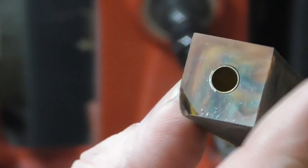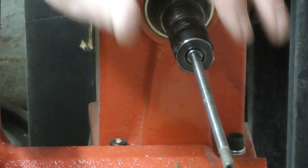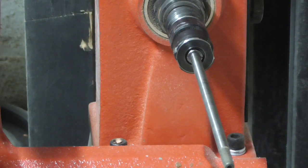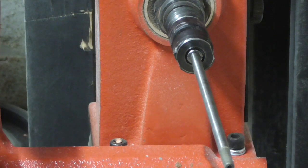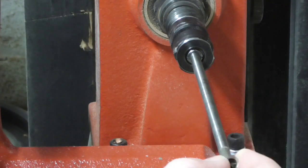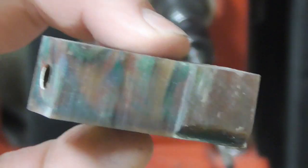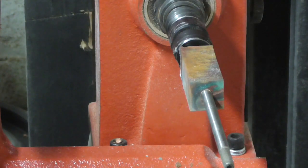Right, I've glued the tubes in and I've flattened the ends off. I'm going to put the pen blanks onto the mandrel now. With these European style pen kits you do get a different bushing set. So you get a really small one which goes at the nib end, so I'll put that one on first. Then I've got my shortest blank. Then that one goes on. Then you've got this one,